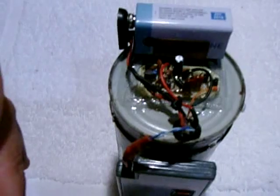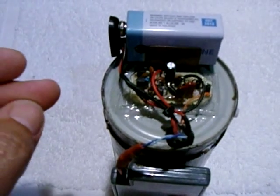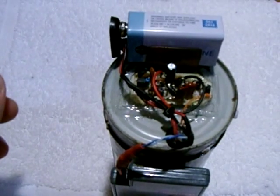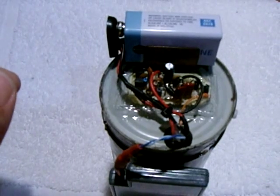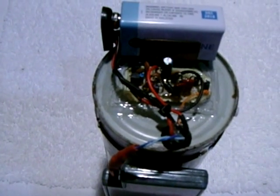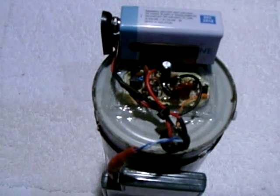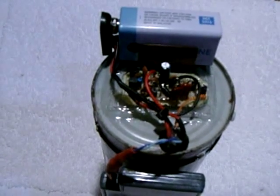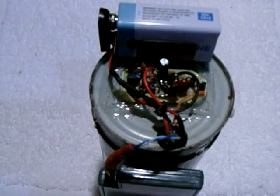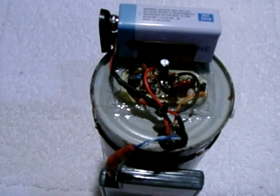I'm probably going to change that insulator out. After speaking to Charles, he informed me that the best insulators to use are clear hard plastics such as styrene, polycarbonates, and acrylics, because they don't have the surface conductivity of other plastics. You don't want anything touching that sense wire — you want the gate of the JFET lifted up off the board, soldered directly to the 1-megohm resistor, and then soldered to the sense wire.